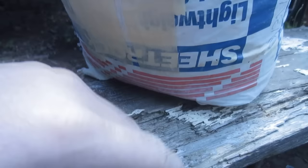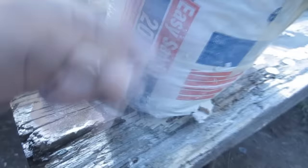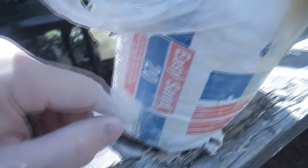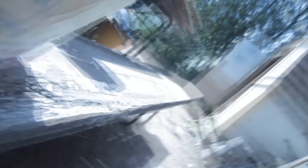This is the stuff I use for the rock texture. It's called lightweight joint compound, also called hot mud. The stuff called hot mud is what they use for drywall seams, and it comes in different set times. This is 20-minute mud, which means it sets up in 20 minutes. You can also get 40-minute or 10-minute versions — it's basically your work time. You can use normal joint compound, but that takes a couple hours to set up, and I want to go faster than that.